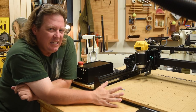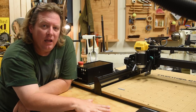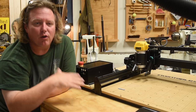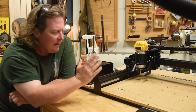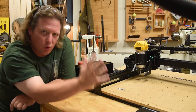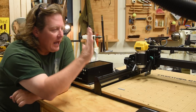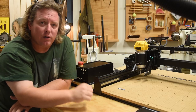In order to get it flat, we have to take into account three different things. Number one: the flatness of your table. If you're not starting out with a very flat surface, you're not going to end up with a flat surface — everything is going to bend toward that and you'll have to deal with it. I've got a little table I built for the first X-Carve, and I've said I'm going to build a dedicated workstation and storage solution. That means all this flatness work I'm doing right now, I'm going to have to redo when I move the X-Carve, because moving it is going to affect the flatness. The table it's sitting on is your number one concern.